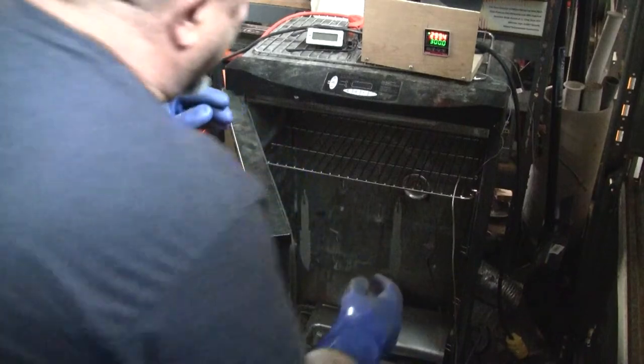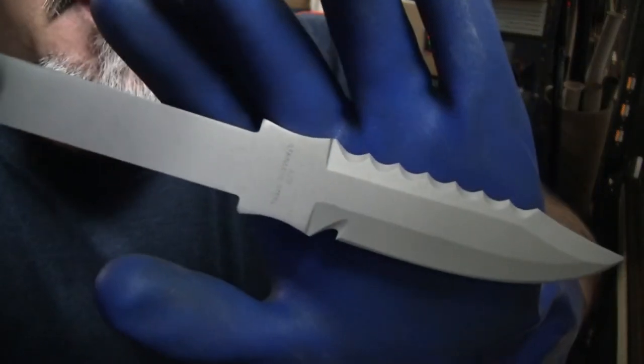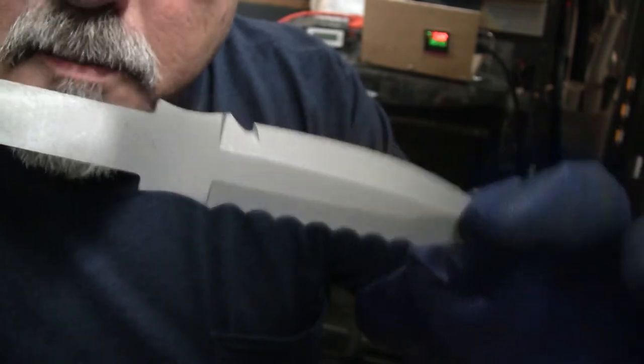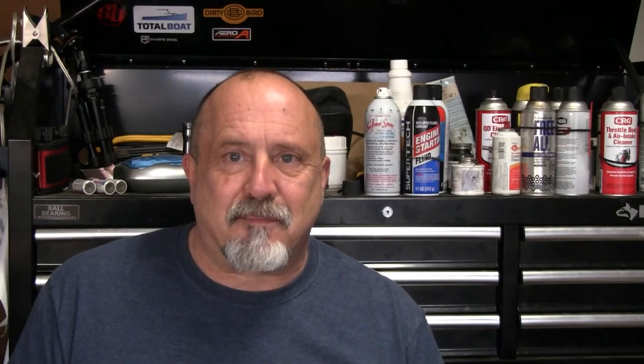These gloves have a lining to protect from heat. After gassing out, we want to inspect the parts — if we see any stains, that means oil came out during the process and we'd have to repeat the acetone degreasing. What we want to see is that they're clean. That was phase 5: gassing out. Phase 6 will be getting the paint ready, and phase 7 will be painting. The knives and parts are cleaned, prepped, blasted, and ready to go. In the next segment I'll cover paint mixing, spraying, baking, and the final product. If you enjoyed this, hit share, like, and don't forget to subscribe.